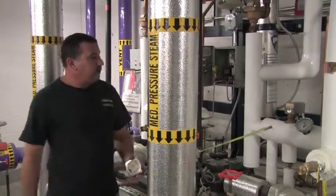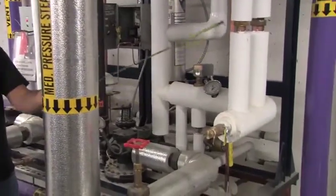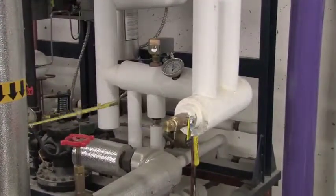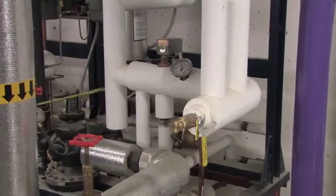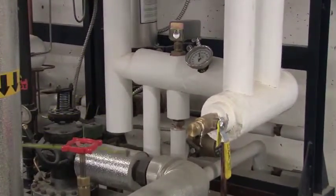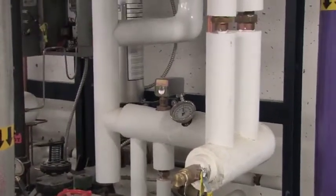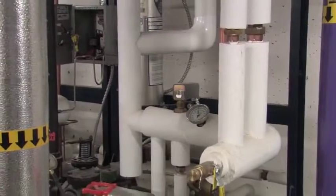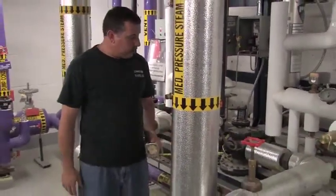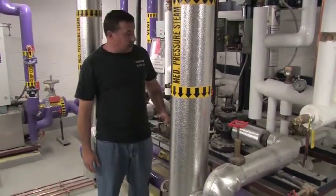We also have a temperature gauge for our inlet water, which is being cycled through the hot water recirc line back to the unit. And like I said, we need to have a minimum flow. There is a check valve on the cold water supply line located here, and our hot water recirc line, which is located here. And that's about all there really is to the unit. There is a steam trap in the main line, which is required. We have strainers protecting the Hoffman valve in the main line, so there should be no issues as far as getting any sediment caught under here.